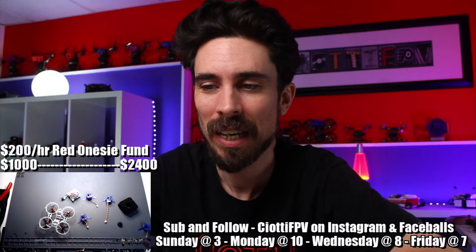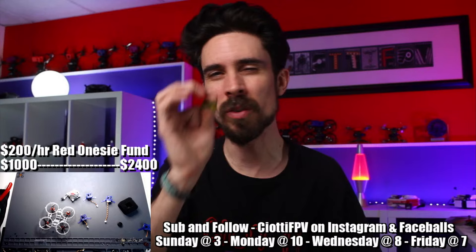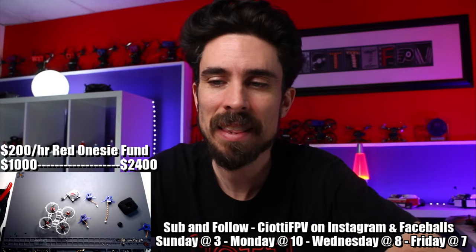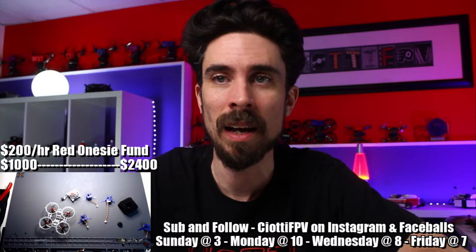For components that are like $50 or less, if it's going to take me more than an hour, I'm just kind of like, you know what, just throw it away and get a new one. I know that's kind of wasteful, but I don't know. I love that that's a possibility, but UART1 on the bottom of the Happy Model board is one of those absolutely tiny little round pads, which is a nightmare to solder to, and then you've got the FTDI adapter. And then you get hooked up to it, and you make changes, and then next time you want to make any changes, you have to do that whole thing again. It's like, yeah, this is a bit much. But I love that there is a way.